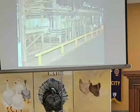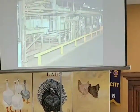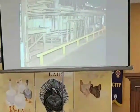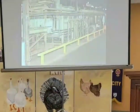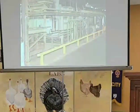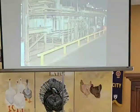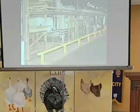From the machine shop, gears and shafts had to be hardened, so they were machined to a reasonably close tolerance and then sent to heat treat to get hardened. A lot of times it was just a surface hardening. This particular furnace was nicknamed the Edsel.